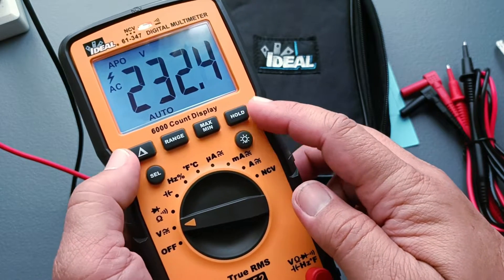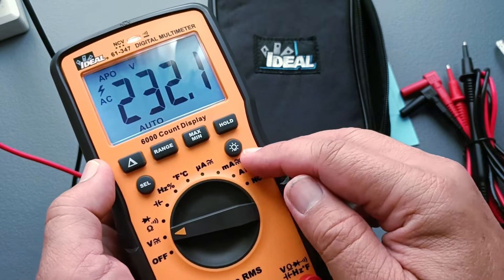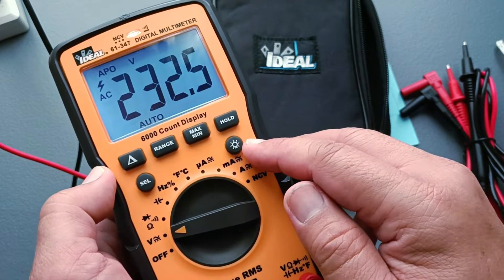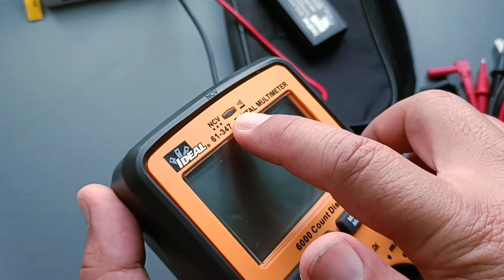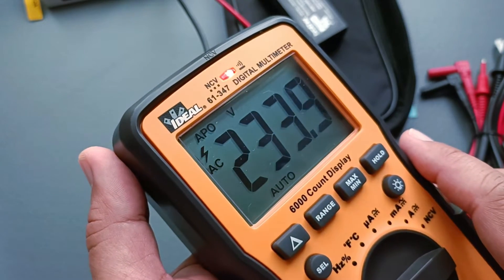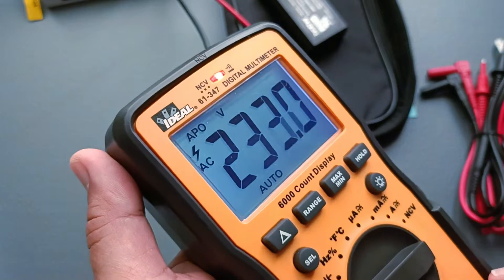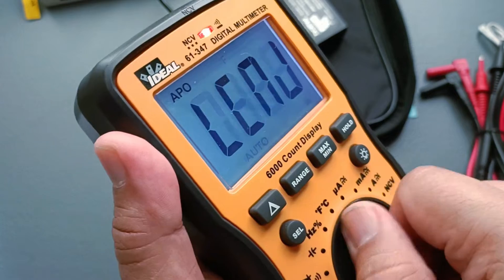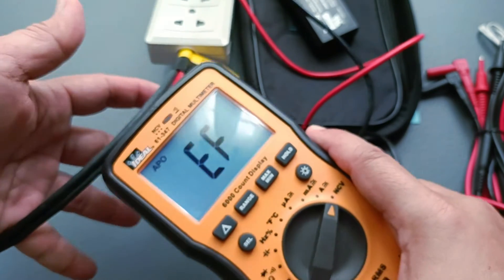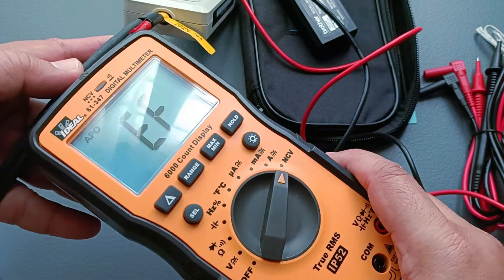The functional buttons have a good tactile feel and respond quickly. This instrument is provided with a backlight and a separate backlight button. The backlight has a duration of a good five minutes, which is very much appreciated. This tiny NCV LED is both an informative and safety feature. When the test equipment is connected to a voltage source higher than 30 volts AC or DC, it will remain lit while the lightning symbol appears on screen. During the NCV detection function, it will also inform you if the line being tested is live, as the NCV detection light will flash together with an audible signal.